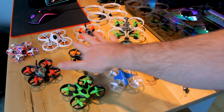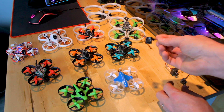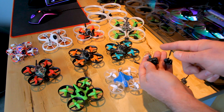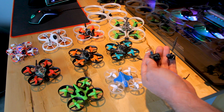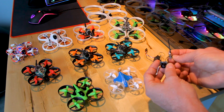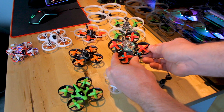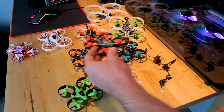You'll need to get a little camera and VTX combo. There's a small lightweight version where they're together, or a split type. The difference between the combined options is the antenna type: a linear antenna is more durable in crashes but doesn't give as good a signal, while a cloverleaf antenna gives a better signal in general but is much more fragile — once bent or damaged it won't perform well. With the split camera/VTX type, you can do a low-profile mount where the VTX sits flat in the back and the camera sits low, making you much less likely to damage the camera, VTX, or antenna, and you can fit through tighter gaps.